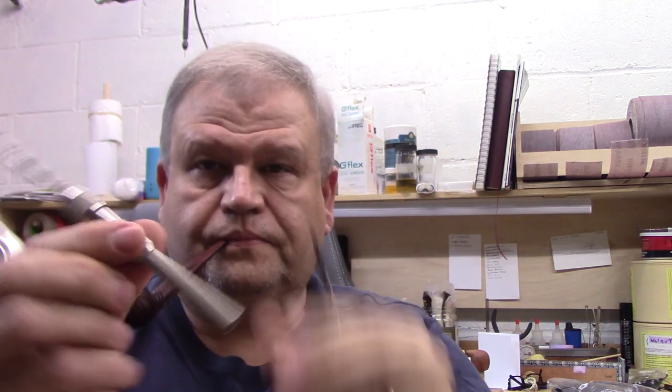If you want, you can just cut some dowels and do that. Or you can get these little pin vises — if you can find them big enough, they're great, and you can put the drill bit in there and hold it that way. Or you can even get a drill chuck — either find one off an old drill, or this one has a number two Morse taper on it for using on a lathe, that I got from Harbor Freight for about $10. So you can do this fairly inexpensively.